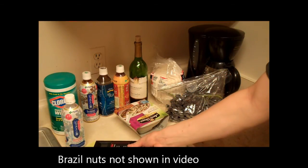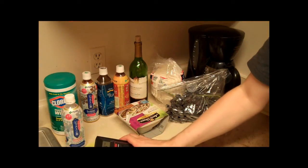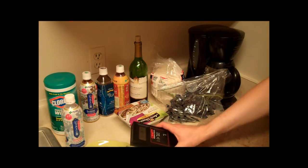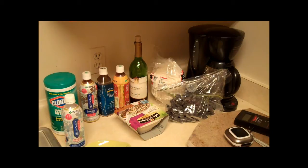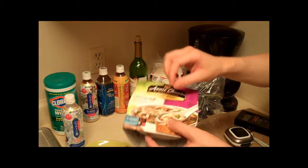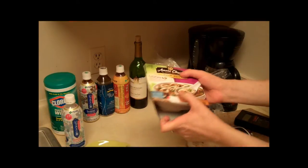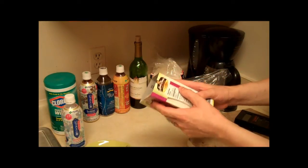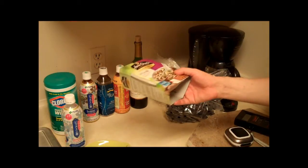As you can see, these Brazil nuts are known to be mildly radioactive — they contain trace amounts of radium — but this Geiger counter cannot detect them. I have tried. When I put it on this piece of radioactive granite, it detects the granite just fine. When you have packaged foods where the radioactivity is emitted in very small amounts and shielded inside a material, it becomes basically impossible with this sort of Geiger counter, and actually very difficult with a regular one.